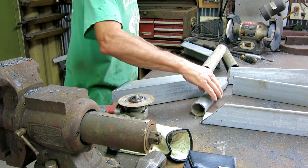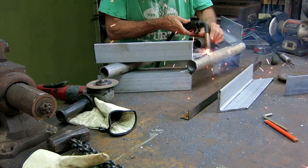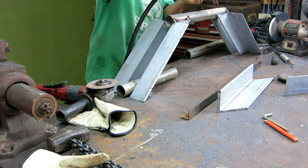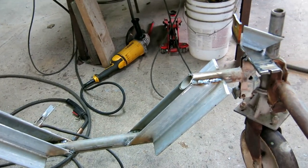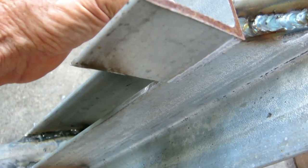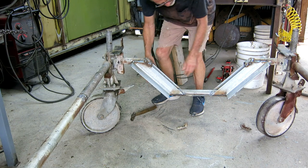So I'm cutting the cross bars at the ends in half and fabricating angle iron drops to get the boat a little lower when it sits on the frame. My welding is usually pretty iffy, but because this is heavy-wall pipe and the angle iron is also fairly heavy wall, I was able to turn up the heat and get some good welds with a lot of inches of weld — I'm pretty confident strength won't be an issue. I got the first drop set in place and welded on top, still need to flip it and weld the bottom, then cut small squares to weld over and tie the pipe more to the angles. The wedge clips are secured with a bolt so there's absolutely no way they can accidentally come undone.